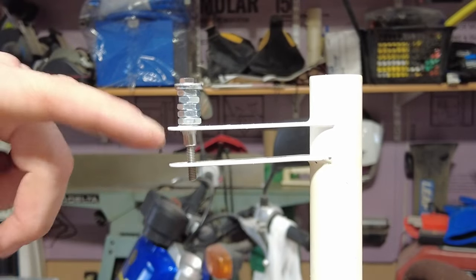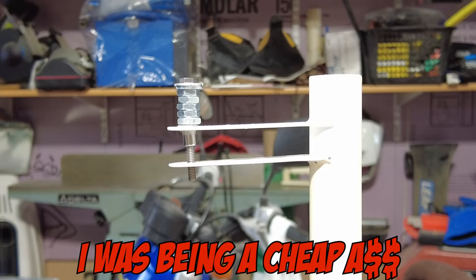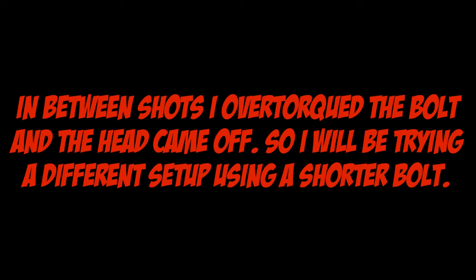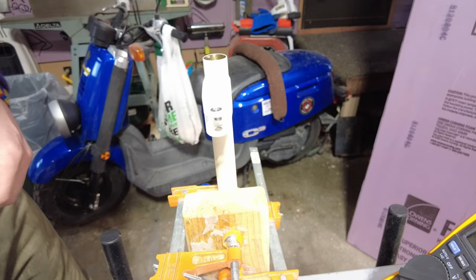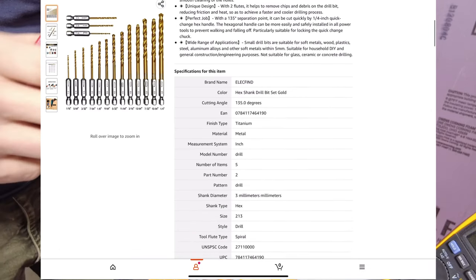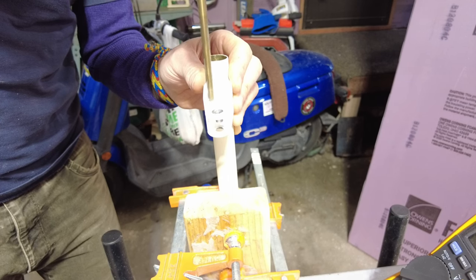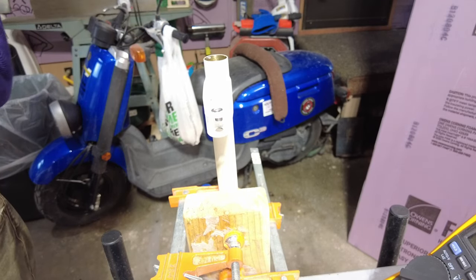I have a feeling I'm bending this bolt because it looks like it's not touching this side of the hole. I assume the threads are catching on the bolt - this probably isn't the best tool. I only have one hole in here so I'm going to drill another hole and try to put another rivnut in. I'll be using these cheap Amazon metric drill bits and see if they'll even drill a hole in this steel. I'm getting nowhere fast - the drill bit is just walking across the material. So let's get a real drill bit and see what the difference is.